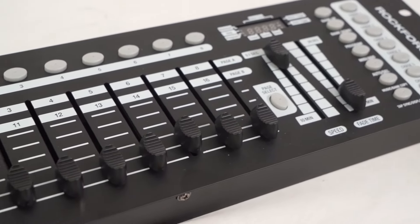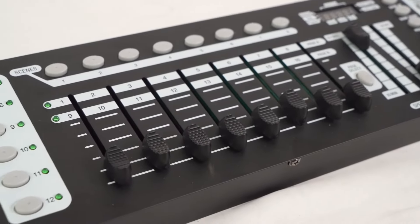When you're just starting out, I would recommend turning all of the scanners on, and then as you get more advanced with your DMX programming and addressing you can select which scanners you want active. Moving along to the right we have our faders. There are eight physical faders, but this DMX controller allows us to control 16 faders by using the page select button. For page A we have faders 1 through 8, and for page B we have faders 9 through 16.